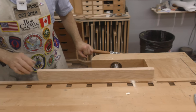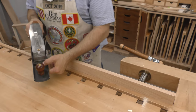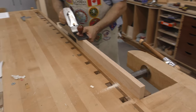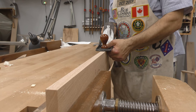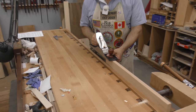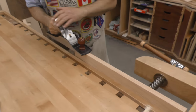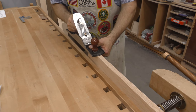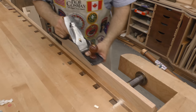A little bit different when you're doing an edge — you want to keep the board in the middle of the blade. The way I prefer to do it is I have my thumb sitting right here, and I use the side of my index finger and the underneath as a fence. When I set that on there, my index finger — you've got to develop a bit of a callous to make this easy — is underneath, thumbs right here. You've got to put a lot of downward pressure because you don't want the plane dropping back before you get started. This is a three-finger grip, and I'm not squeezing it. I'm going to move my body, not my arms. This is mostly a leg exercise.